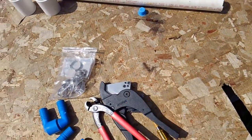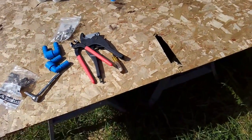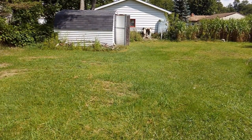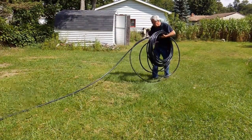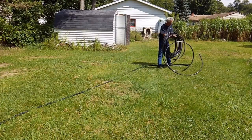There's all the stuff we need to put in a couple of wells. Look at those little blue turnaround tubes right there — you're going to see more of those in a minute. If you're going to put down the geo well, you've got to have holes in the ground and you've got to have tubes to put in those holes. First thing you do is lay out your tubes, measure them, cut them to length — if you know how deep you're going to drill your holes.